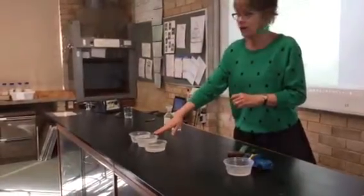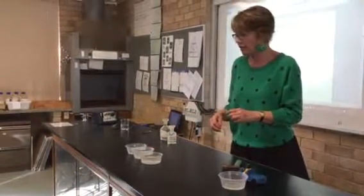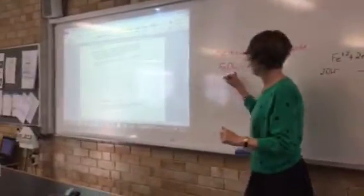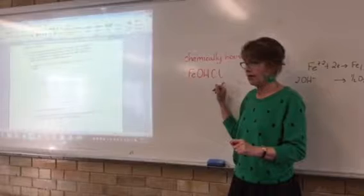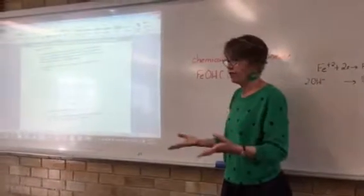We know chloride cannot stay there because if we leave any there, it's going to lead to further rusting. Now that's going to remove the chloride that isn't chemically bound. We know that some of it is as iron hydroxychloride, and that can only be got out with chemical means that we'll do in our last step. But it will remove all the chloride that is just free.